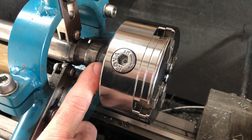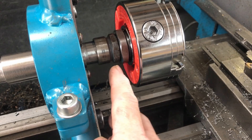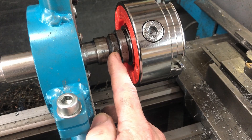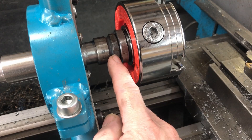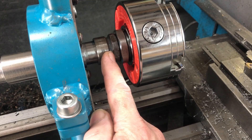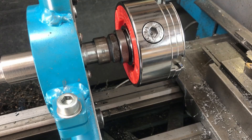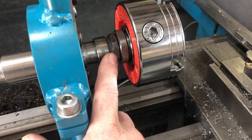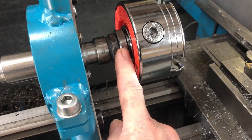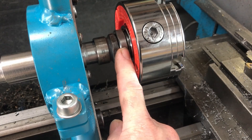The collar tightens up onto that bearing race and then should have a flush and true face on the outside, and that's where the chuck nut registers onto that front face. I did run it a little while ago and it was a little bit wobbly, so I think I'll make a new part for this — a little bit bigger in this area to match the nut. I'll put the bearing on, tighten the new piece onto the thread so it's up against the bearing, then machine the front of it so it's all running true. Then when the chuck is put on, the big nut will tighten up flush onto that new piece.